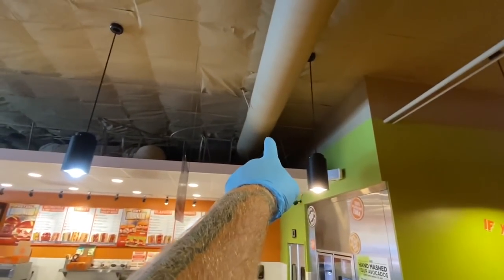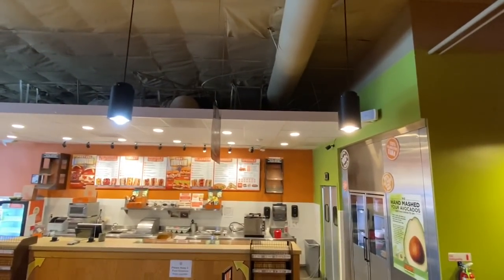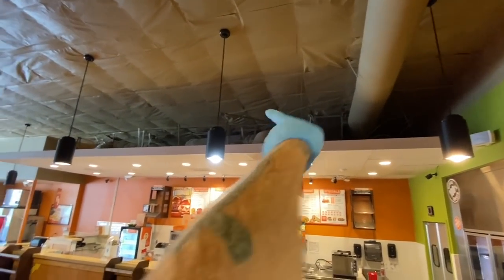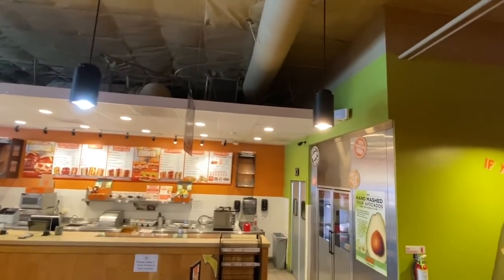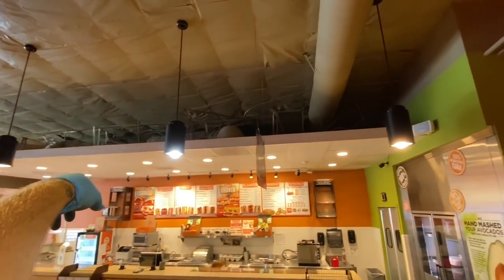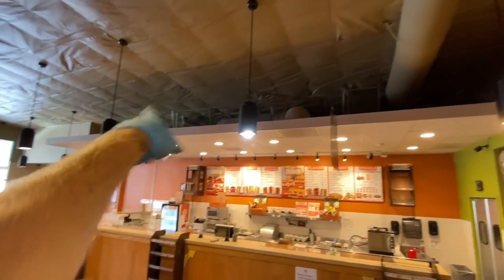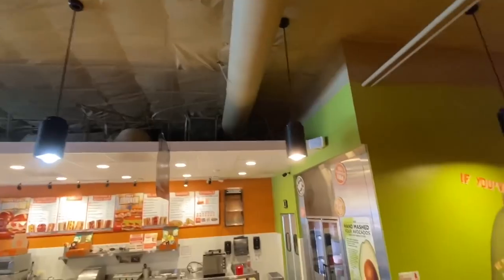So that's your supply trunk. That's your return. And then they also ran this return to it. It goes up and then loops back around and into the plenum. So they're pulling one return from under here for the workers, and they got some supplies tapped in also. They got one register over there, two, three, and then, yeah, three and a return. And then all this supply trunk.